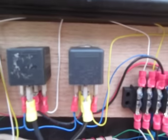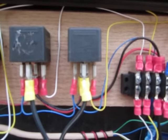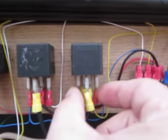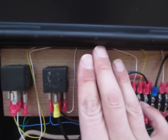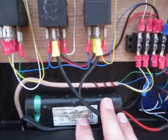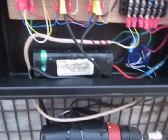No, that's not focusing very well, I apologize. It's not focusing well at all. But suffice it to say that 85 and 86 are the outside terminals, and they are what turn the relay on and off. So if I interrupt that power, I don't leave the relay on all day or all night, which will save my battery. Okay, YouTube folks, that's how it works.